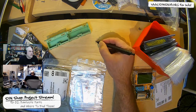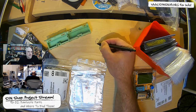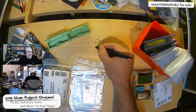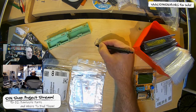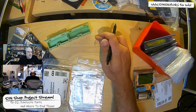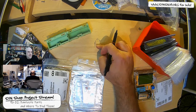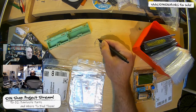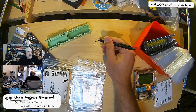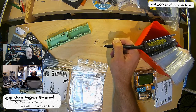Well, what a lot of audio mixing board manufacturers will do is they'll have these things that come out from the side, and they'll have their main board down here, and a daughter board that pokes up like that, right? So that means this is cantilevered. If something pushes down on the knob, that wears out over time. Now, granted, they put the cap fairly close to the faceplate of the mixer, so it doesn't impact it that much, but with enough wiggling back and forth, eventually this right here is going to break, right?